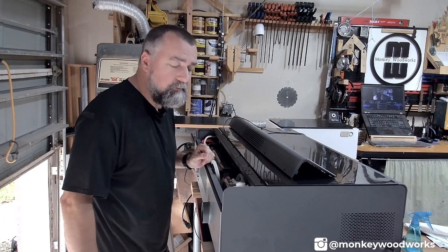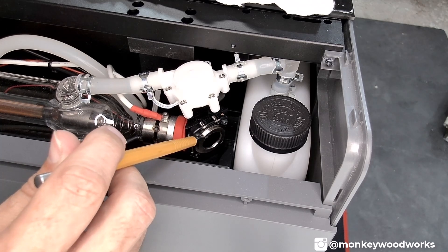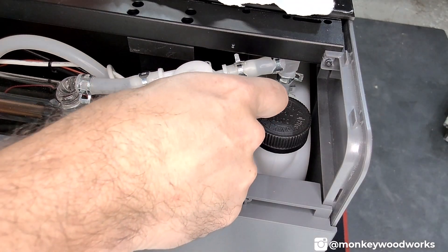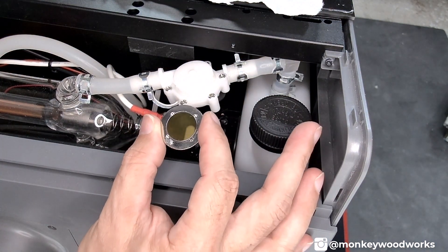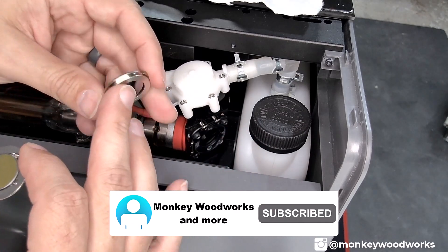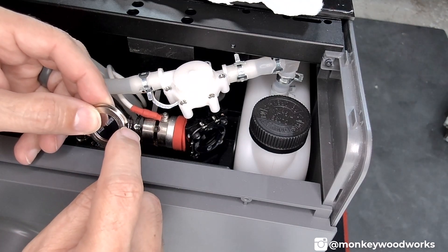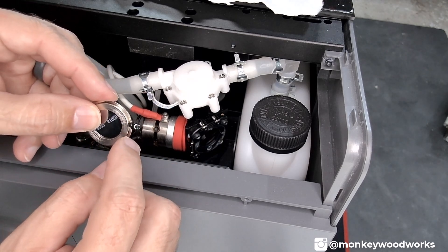Now I have my camera cable here, so I'm just going to slide this up out of the way. Let's zoom in and look at this mirror. This right here is our first mirror — it's actually the hardest to remove; once you do this one, the rest are easy. To get it out, slip your fingernail inside this groove with your thumb and pull it out. My mirror is a full circle because my machine is a pre-production machine, but the original mirrors have a groove inside. When you pull out your mirrors, you're going to have that groove. To put it back in, align the groove with the notch on the holder, so pay attention to where that groove is when you pull it out.